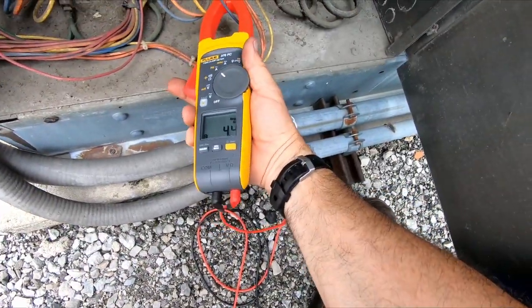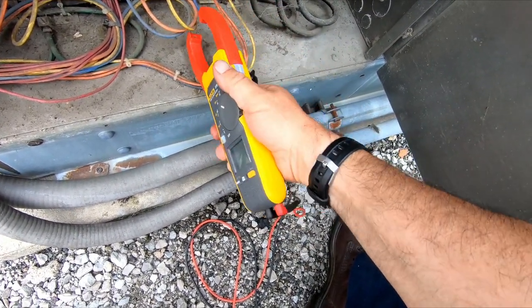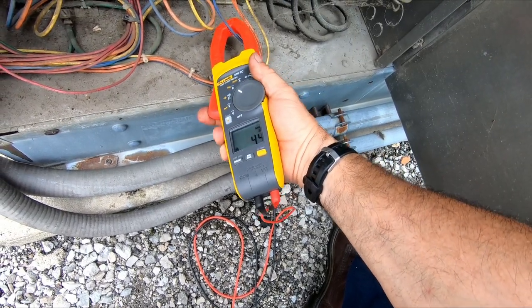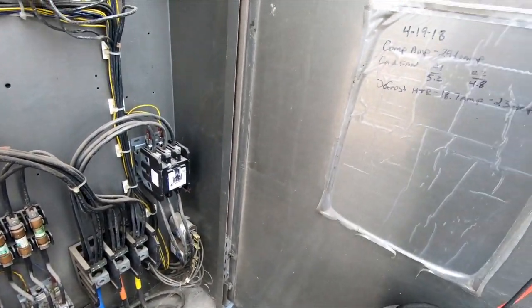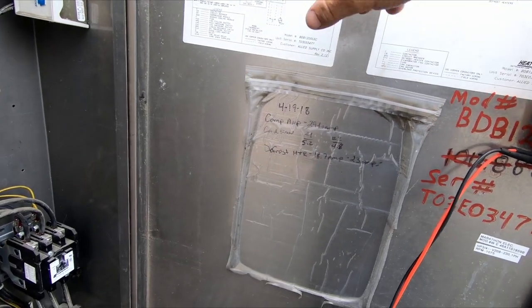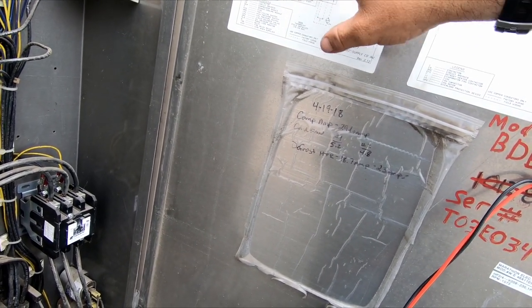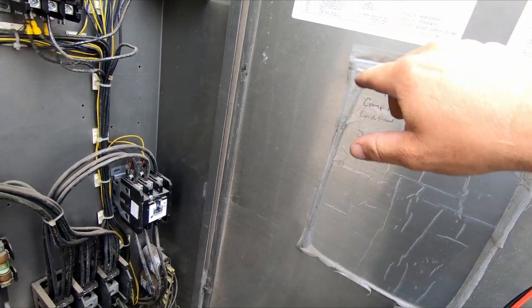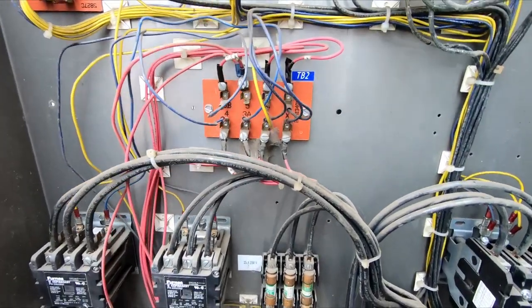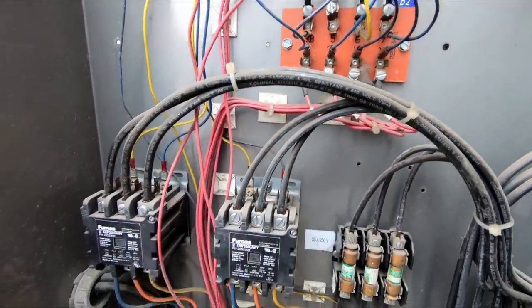Our evaporator fans are calling. Each one of them's got power on them. So we got our evaporator fans, power block to there, should defrost here, so I'm sure these two here. Here is pump down switch. We need to find our thermostat, high pressure, low pressure, liquid line solenoid on 5. 5 goes out and 6 comes back. So if they wired it that way, there's 5.